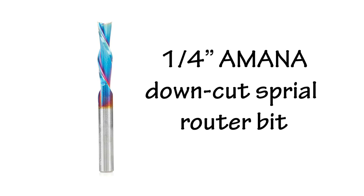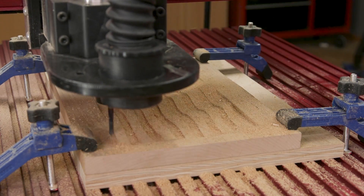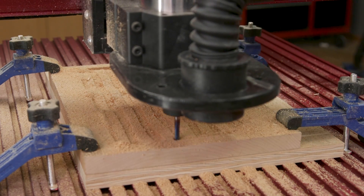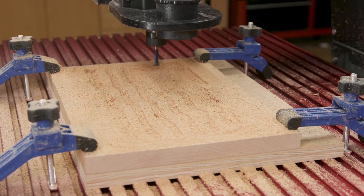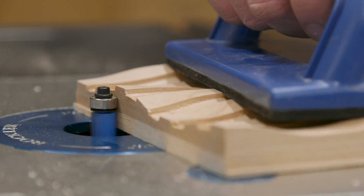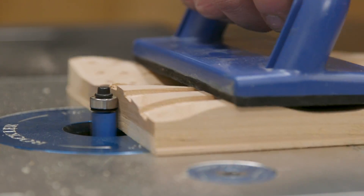So this is pretty cool. You're almost done. How do you finish it off? One step left. We're going to use this quarter-inch downcut spiral bit from Amana, and it's going to cut almost all the way through our blank, just leaving a slight onion skin. Now we'll take it over to the router table, trim it perfectly smooth, and it's going to be great.